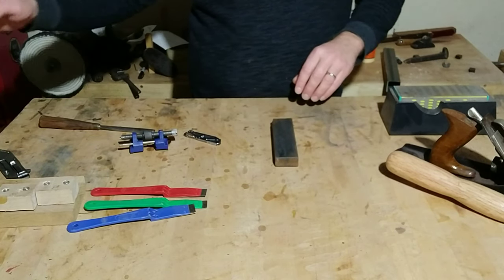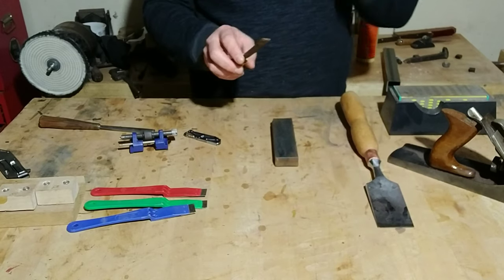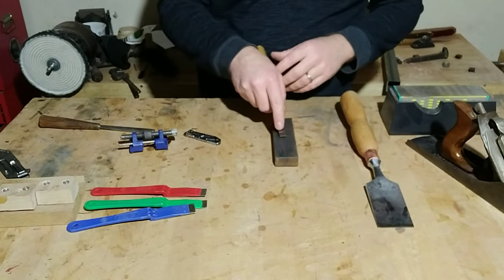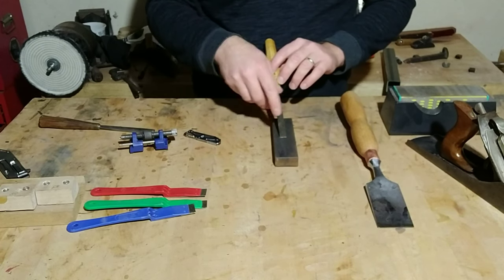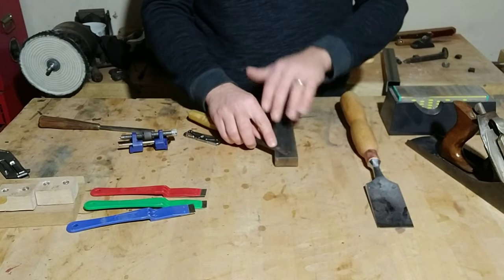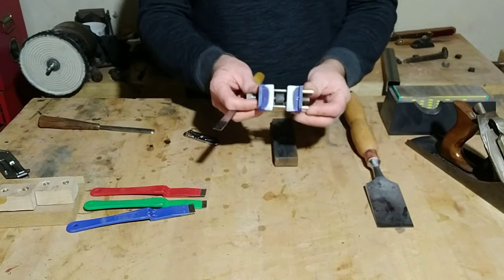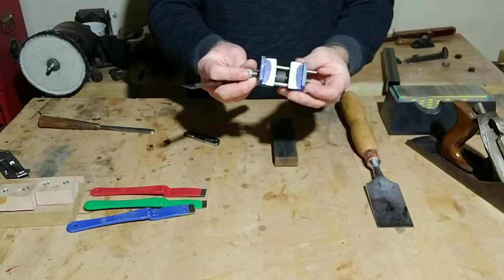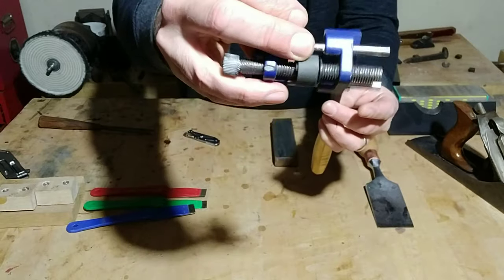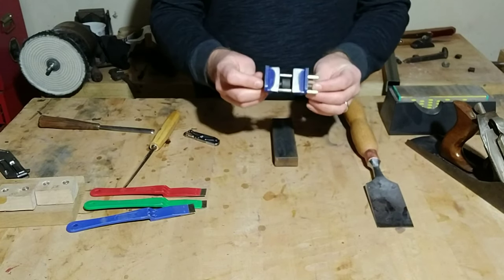We'll look at a straight chisel — I've got two different kinds here, a very large one and a very thin one. When doing chisels, and it's the same process with hand planes, you have to be very good at keeping the angle consistent. I always start by flattening the back edge straight across the stone, adding a little finger pressure to keep it flat. You can also use a honing guide: clamp the chisel in, and the guide's little wheel runs across the stone to help maintain the bevel angle. These are generally made for wider chisels and hand planes.